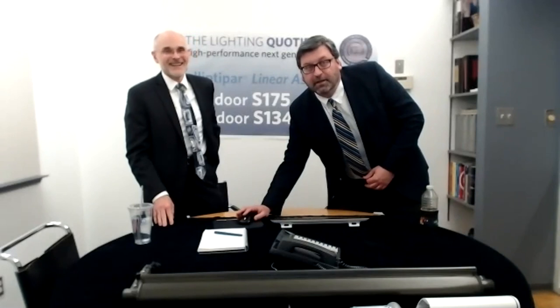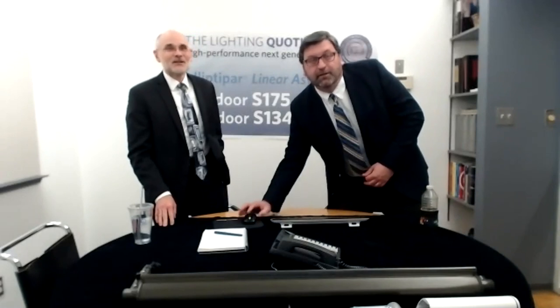Now we have a question. Oh, we do? Oh, we got a question. What is the ideal setback? 12 or 18 inches. Especially for 20-foot ceiling mounted 10 feet. For that, sure, I would say 12 or 18 works fine. I'd like to see 18. You'll just see more uniformity. If somebody objects to coming out 18 inches, 12 is fine. Facing up, yeah. 12 will work. 18 will appear more uniform. There's absolutely no reason to go out 24 inches, though.